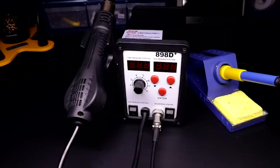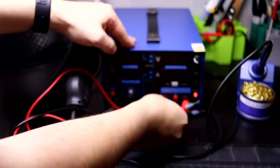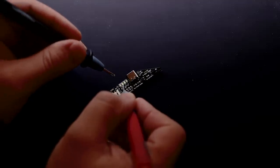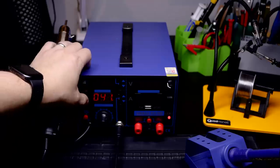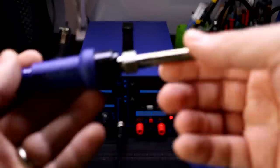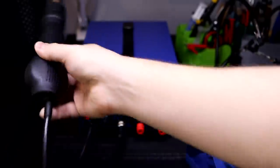Right next to the Glowforge is my soldering station. Last year when I did a video like this I was using a model called the 898D+ — still a fantastic option and one I recommend to people getting into electronics. This one is called the 853D, and I upgraded to it for one feature in particular: the built-in power supply. If you're working on a project and you want to test something like some LEDs, you can just set the voltage to exactly what you want without messing with any USB power supply. The only thing I'm not a fan of is the power switch on the back — each component like the hot air rework gun and soldering iron have their own switches, but there's also one on the back you have to flip to turn off the segmented displays. Other than that it's pretty much identical to the 898D+, with the same soldering iron with removable Hakko-compatible tips. If you're looking for a step up from the 898, I've been pretty happy with this. I'll put links to both models in the description.